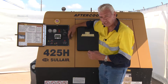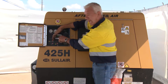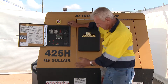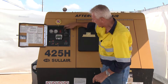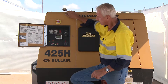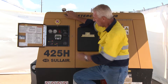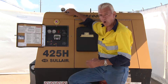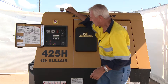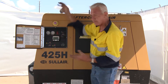Now it's in the warm-up procedure. Leave it 30 seconds to warm up. The computer is now telling me the revs — it's normally around 1600, which is very good to start up with. The valves still remain shut; I can't do anything until I've let it have this warm-up procedure. Be patient and let the machine warm up. Premature pressure requirement on the machine is too much of a shock for the system, so just wait and watch your air pressure coming up, watching compression temperature.